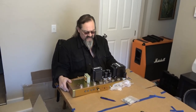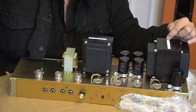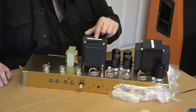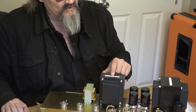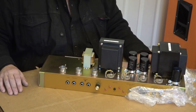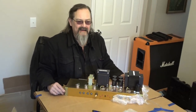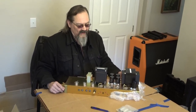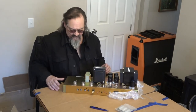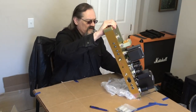There's the back — can you zoom in on that, John? This is the back of the chassis. The transformer says 'Brit 100 PT' — power transformer, 120 volt, 230 volt, 240 volt. And this is a Plexi 100 watt OT, dated 27 February 2023, so this thing was just made. He's got a six-month backlog, but from the time this transformer went in to when I received it was less than a month.